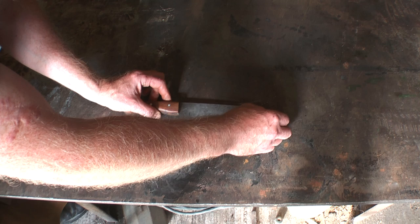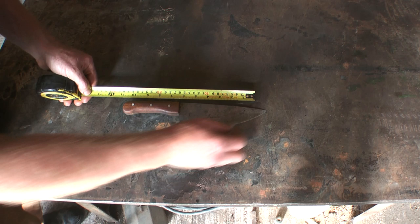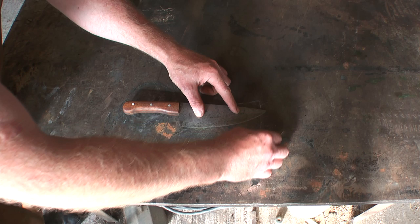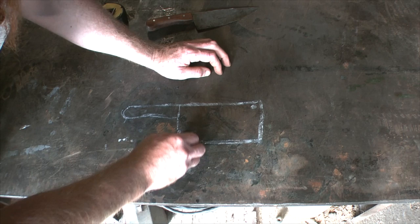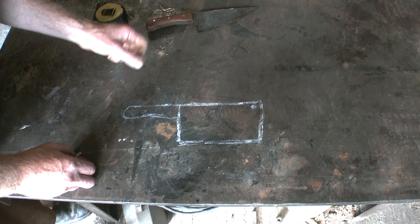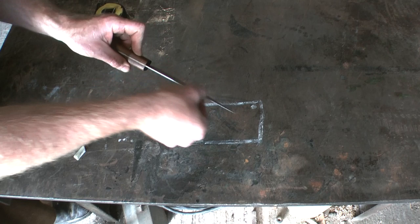And then the blade. We've got 6 inches there, so I think the blade's slightly shorter than this one, and it's going to come down and I'll have something like that. Something like that. It's not much of a plan, but I think it will do. So like I say, about twice that, about 4 mil on the back of the spine. No taper, this one tapers down towards the tip, a distal taper that way.